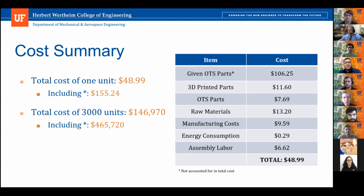Hi, this is Elise from Cummins. I was just wondering, how does the mirror mount to the support? Currently, the mirror we were given has its adhesive on the back, and so we affixed it that way. In a final design, that's not really the best for longevity, so there'd be a more permanent fastener we'd probably implement. Our mirror plate has holes for additional 1/4-20 bolts. In our final CAD, we didn't have that since we were just using the adhesive, but we would plan to use 4 1/4-20 bolts to secure the mirror. Okay, thanks.